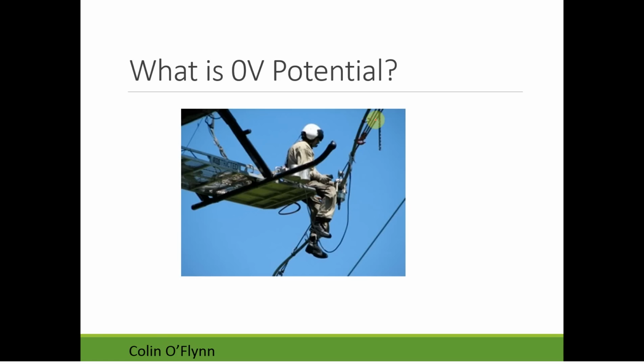That's why these guys here, people doing service on high voltage wires, can be at 200 kilovolts and well above that. And they're sitting on the wire perfectly safe, relatively safe, I guess, from a helicopter. That's because there's no potential voltage. Even though there's 200 kilovolts between that wire and ground, between the helicopter mainframe and that wire, there's 0 volts. And between this guy and that wire, there's 0 volts. So they don't care that it's 200 kilovolts. That's completely irrelevant to them, effectively.